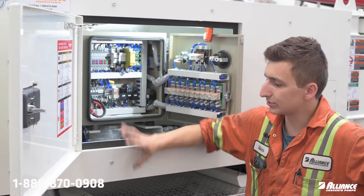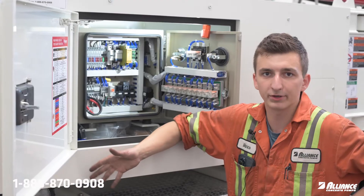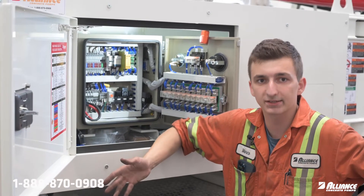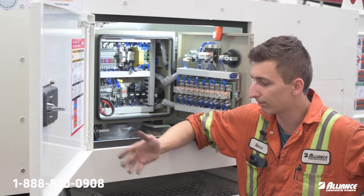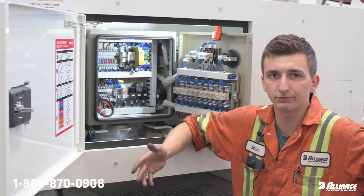Fed from the batteries, it goes to the breaker box with the 60-amp yellow Pollock breaker, which is a manual resetting breaker — we've gone over that in a previous Tech Tip if you have any problems with that — and then a 30-amp and a 20-amp self-resetting breaker.